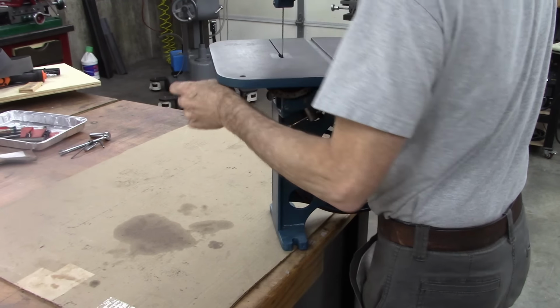Okay, here's the idea. There's the woodworking speed, and here's the metalworking speed. Now, how much shorter? I'm going to say 3/16. That's really hard to determine. So we'll add 3/4 to that. That's the length of the skive. Skive is the ground spot for the joint.